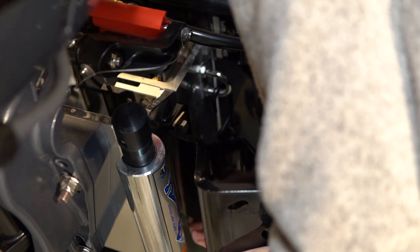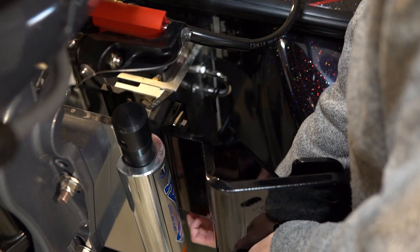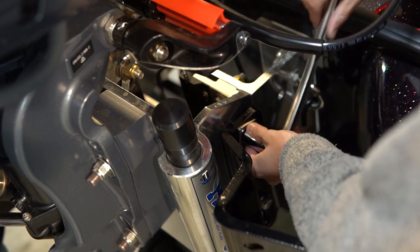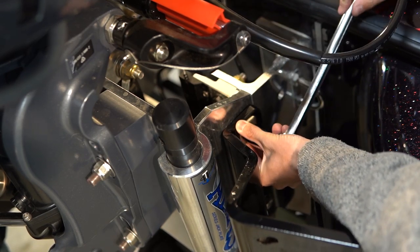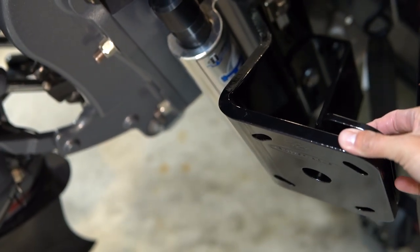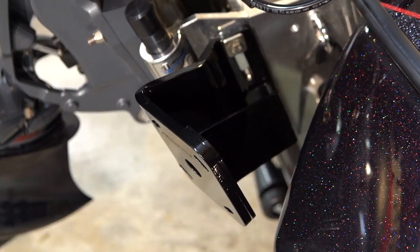Don't get the bolt fully tight the first time because you have several bolts to put through. You have a second bracket to line up on the outside of the first bracket — slide the two together, find the hole, and slide them in. My dad on the other side of the boat is screwing in the other side, which is why it's helpful to have a buddy. All the big nuts and bolts on a PowerPole system are three-quarter inch, so use a ratchet wrench and have your dad hold the other side — get them tight enough to hold, but not super tight yet. Just like that, the brackets are on.